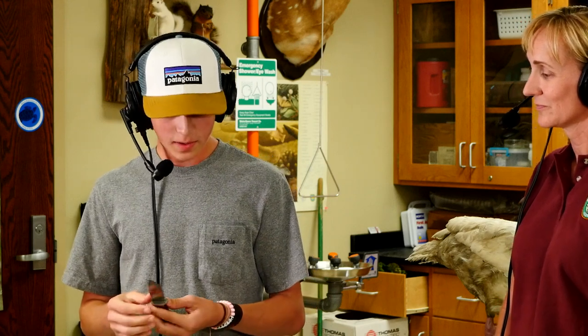This started off as a block, and I would do the rough shaping, put that in, and then just take all my time sanding to get the right tolerances and match it up with this. Do you have to figure out where it fits nicely in your hand and determine the dips? A lot of times I'll start out a handle really large for the size, and then just slowly feel. My hand is different than everybody else's. Right. I have big hands, but you just feel until you find one spot that's kind of digging in, so you'll take that out and go from there.